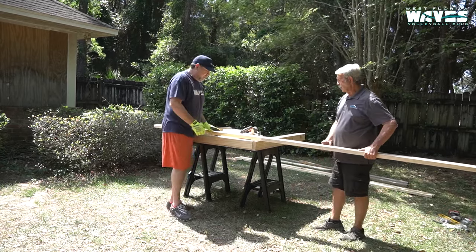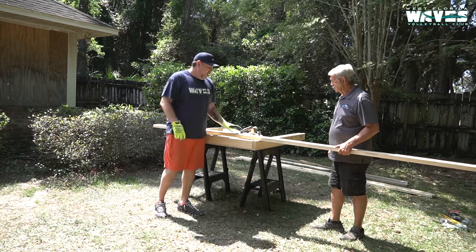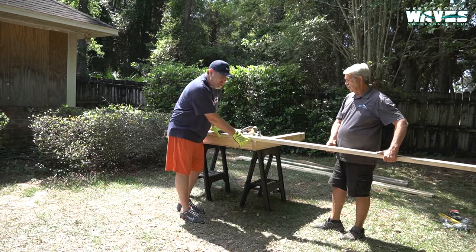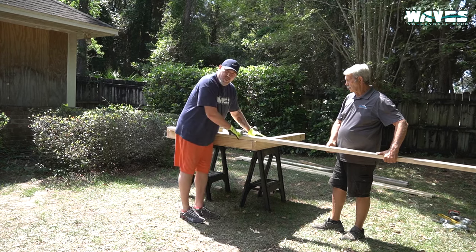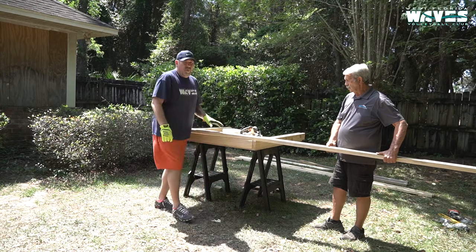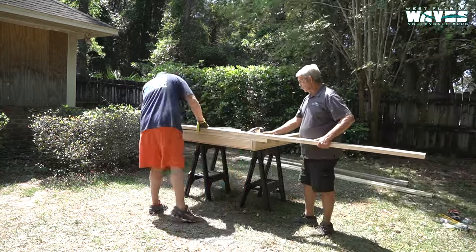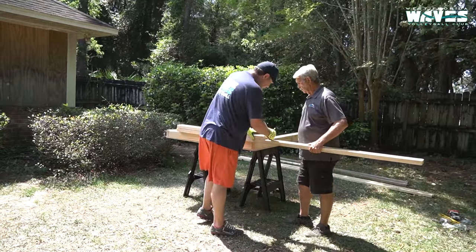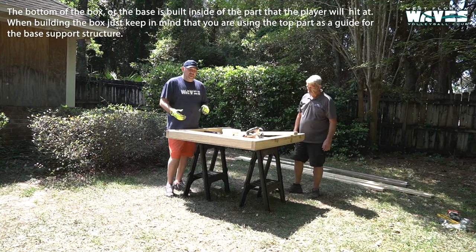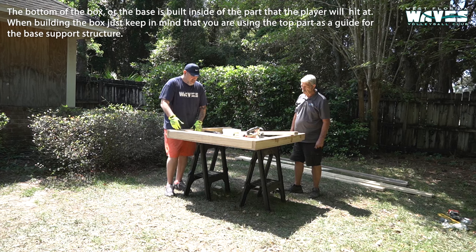One of the things we learned when building these boxes is that you can use the end board to make the inside part of your support box, with one small detail we found out the hard way. When you make your mark for the board, come in about a quarter or an eighth of an inch so you've got room to fit inside the box. Also, when putting your inner support box together, make sure you give a little bit of clearance — don't make it snug up against the outside of the top bar or it's going to have a hard time closing when you try to collapse it. We're putting together the base or platform for the box, so there's no need to screw from underneath. We're going to make all these screws into the top or base of the box.